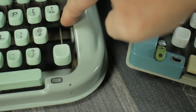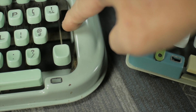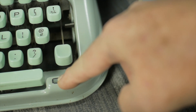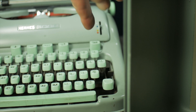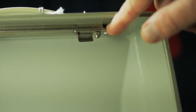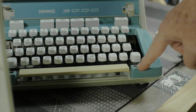This 1961 model was a transitional point in the first version of the Hermes 3000. The earlier style of lid latch uses this bracket, but a later-style lid — the middle range of this body style — would also fit into this groove. Here you can see the linkage on the lid system: a push button causes this to move. This is the earlier style, and the corresponding place where it engages is this rear bracket. Whereas on the later 1972 version, there is a sliding lever on the right side of the grip that slides two brackets sideways to engage the recessed holes on either side of the space bar.